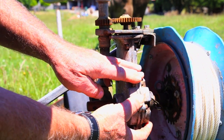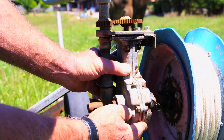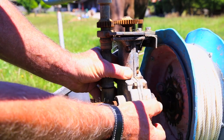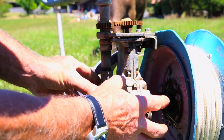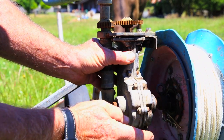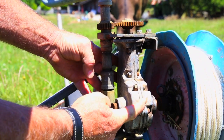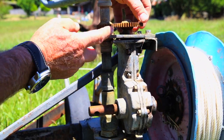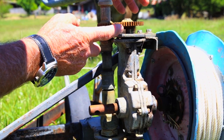This is the main gearbox here. It's a worm drive gearbox off a little hand held cultivator — it was actually a Ryobi that I found. I just took the gearbox off it and that has a 40 to 1 reduction in it. The shaft comes out of the top and then I've got two gears out of a little Briggs and Stratton engine.